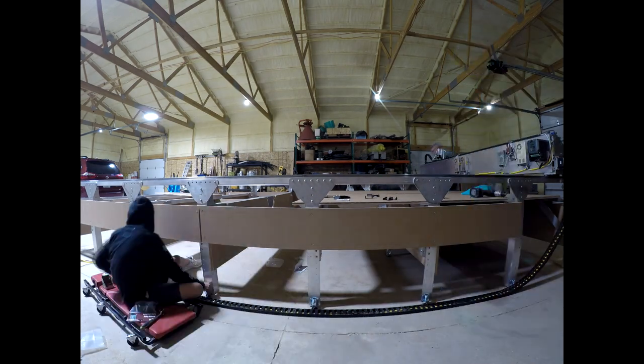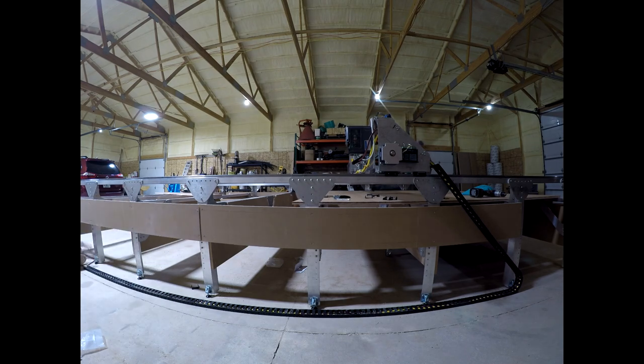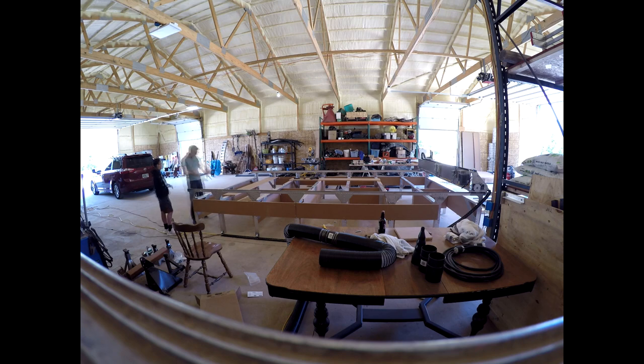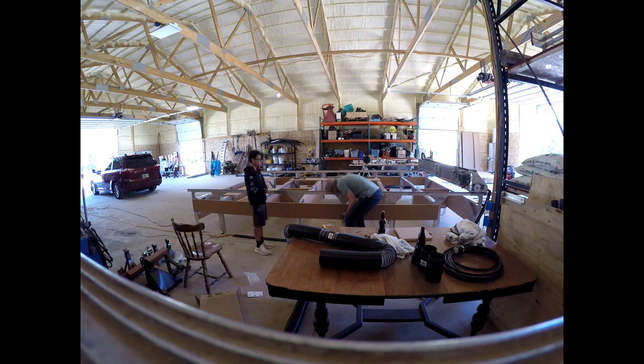You can see my son Nicholas under the machine from time to time, installing the leg levelers onto the bottom of each leg. The leg levelers along the sides are mainly to keep the gantry rails as straight as possible. I also want to make sure that the table is flat, first by adjusting the brackets until all of the ribs are level and show no torsion with respect to each other. I use my eye and look down the entire table to inspect the alignment of all the ribs.